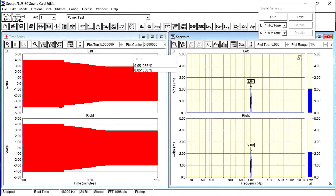Let's calculate how many watts we're actually getting at 0.05% distortion. We square the voltage and divide by the impedance: 20.4 squared is 416.16, divided by 8 ohms is 52 watts. So at the rated distortion, the amp really isn't 100 watts — it's actually 52 watts. This doesn't surprise me as that seems more in line with what I expected. Nonetheless, 100 watts per channel at 0.15% distortion is still very good, and this amp is capable of outputting pretty high power with a pretty clean signal — not quite as good as claimed, but for an amp of this class, still very good results.